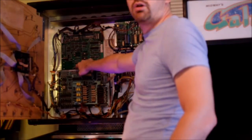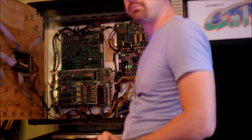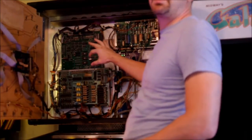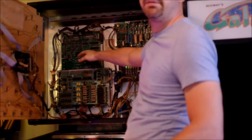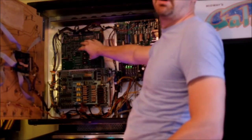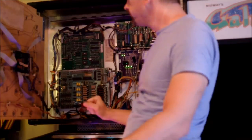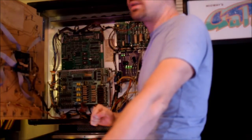Generally you're going to have four ROM chips in there, unless you have a configuration like mine using the Hyperbolt type setup for more ROM space, which has three of the 2532 EPROMs. Most of the time you're going to have four EPROMs: two of the 2532s and two of the 2716s.